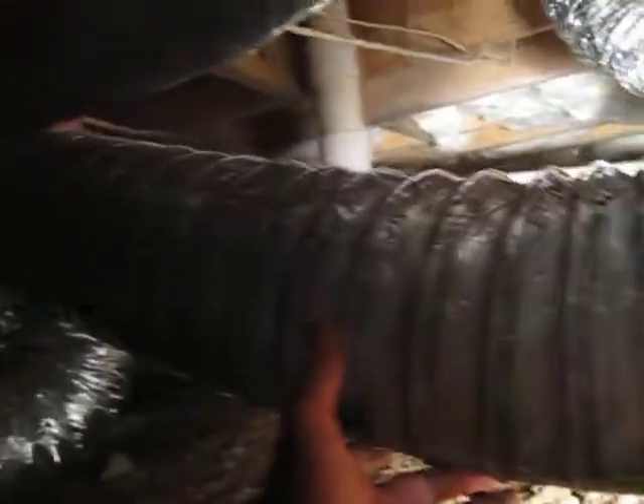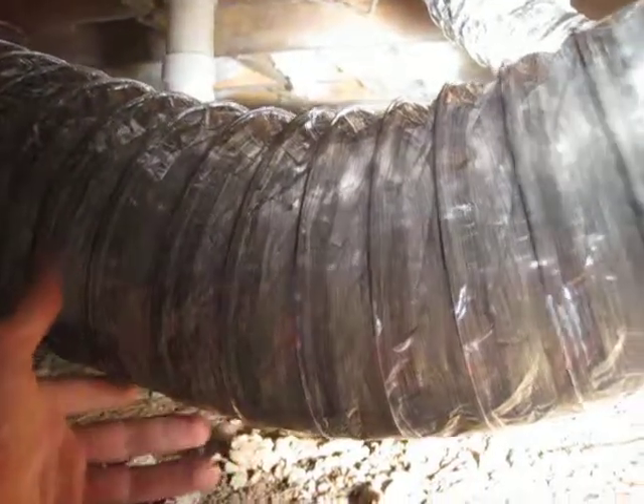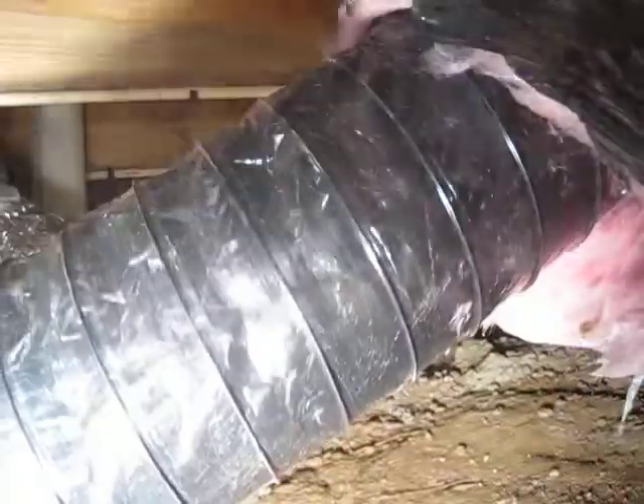Hello, this is the duct that was first exposed on Tuesday, July 18th by the folks from Thomas Heating and Air. They diagnosed it with simply saturation and condensation on the outer insulation layer of this flex duct. It was cut into and removed and said to dry out.